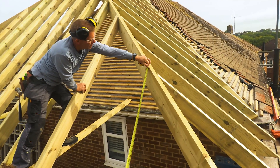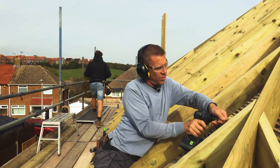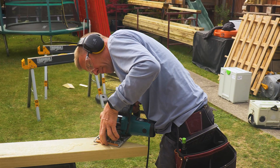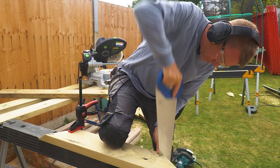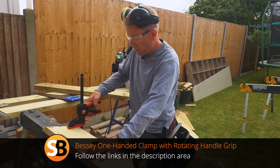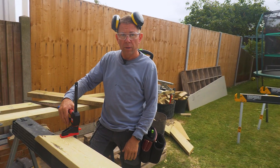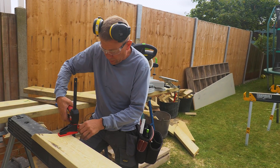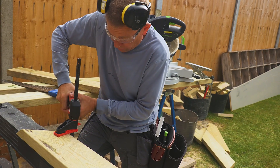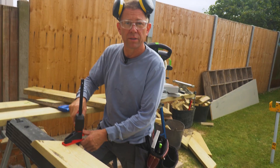Can you go out that far? 12.75. It's slightly twisted — there's only one spike in it, so I'll put a couple in just to fire it on. So it's another end done, all complete. I'm going to get the front bit done. The front's exactly the same — it's out of square. This is 83 degrees, it's a 7 degree difference under. As you can see with the square we are well under there, so all these cuts we're cutting at under 45 — 43 and a half — and out the back 48 and a half. Same principle: just measure them again at 43 and a half, lay the saw over, and then 38 degree plumb cut for the main roof.